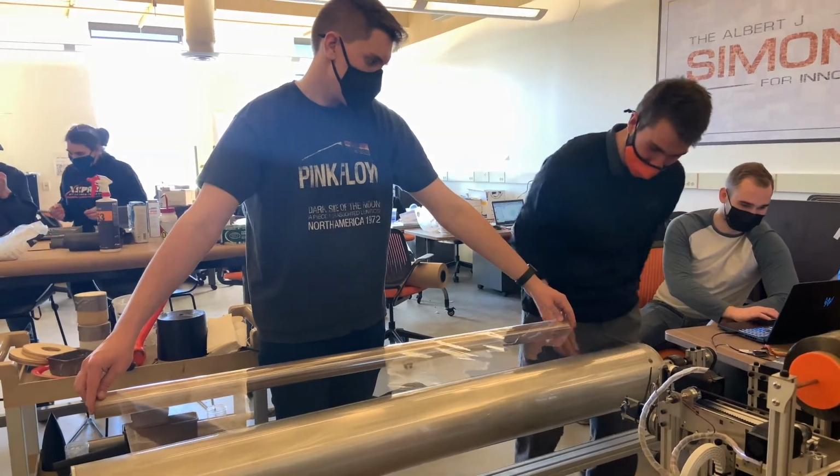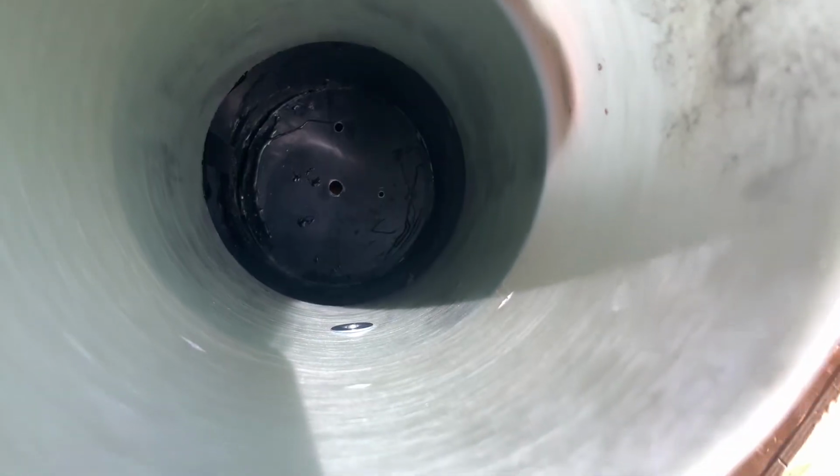of the rocket. This year's airframe consists of two 6-inch body tubes. The body tubes are custom filament wound using an X-winder machine and carbon fiber tow. The tubes consist of 3 layers following a 60, 90, and 60 degree weave pattern. These parameters were selected for the flight forces and pressures, and also to manage the manufacturing challenges with the tube